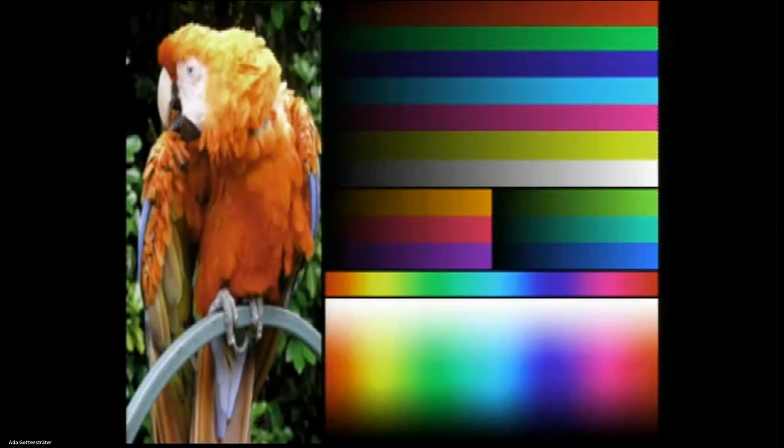Multiple video ports, and they're all running off of one cog. Well, I say that's a lie. Of course, the Mandelbrot here has to be computed by a different cog. And this sort of alpha blend effect also has to be computed by another cog, but it's just an example that I made a long time ago. But the display driver is a single cog doing 4 separate ports. Yes, how does this evil magic work? Very cool. The answer is artifact colors. There's only one color modulator, but if you use artifact colors, you don't need the others. And it turns out you can do a lot of things with artifact colors, such as alpha blending.